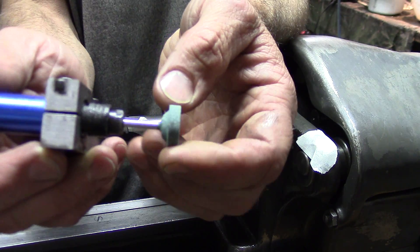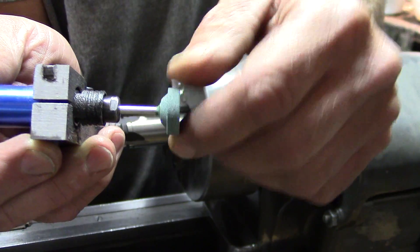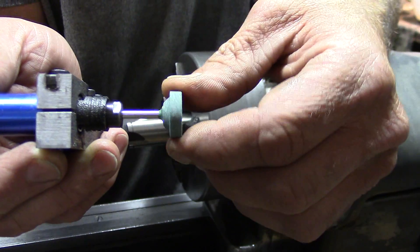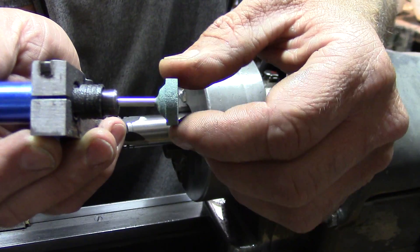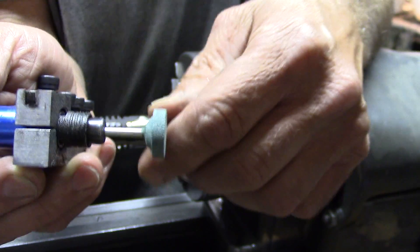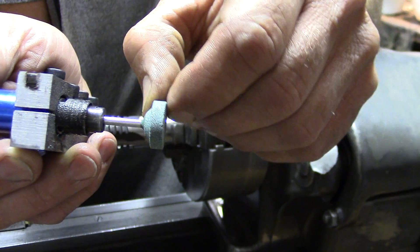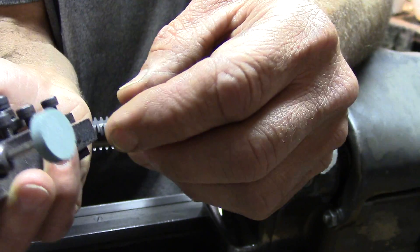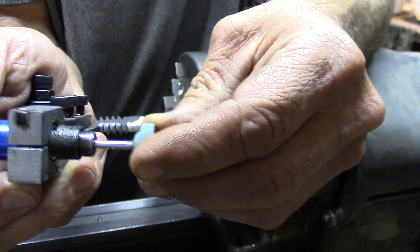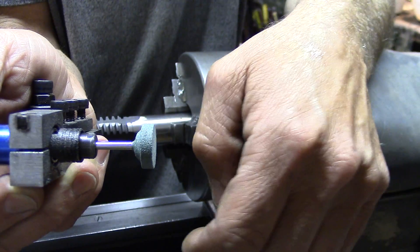This narrower wheel — sorry, I had an accident yesterday, my head is a little screwed up right now. Just don't fall off your bike and you'll be okay. Now, this little wheel here, it's narrow and it creates less pressure, so you're not getting so much flex in the shaft, so the finish came out really well.